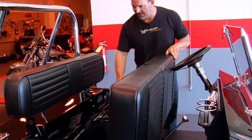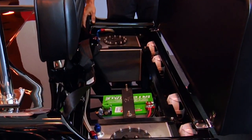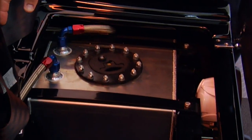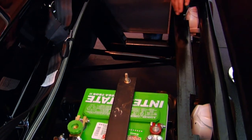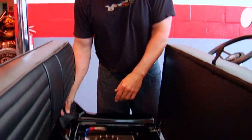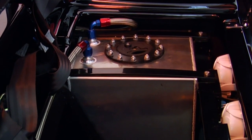The battery and gas tanks are right back here. You've got two fuel cells, all plumbed with Russell fittings — two five-gallon tanks — and it's got a big Interstate battery. That little driveshaft connects the Turbo 350 transmission to the big Ford nine-inch rear end, so this thing is bulletproof. You can see the three-link suspension system — everything's been painted or powder coated. The speakers are marine speakers, so if they get wet, no big deal. We used the best of everything: braided steel, Russell fittings, all AN fittings. There was no budget on this build.